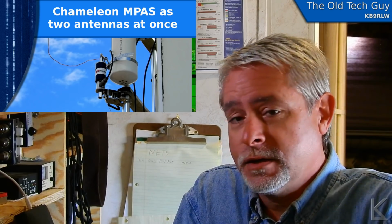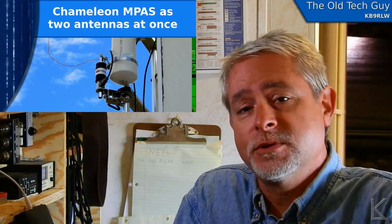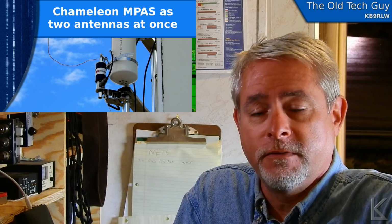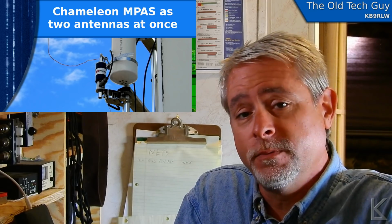I've been talking to some guys on 80 meters, 75 meters at night. The footprint seems pretty good. I got from here up to Middle California okay, and I talked to James just 112 miles or so north in Kingman. So the NVIS wire is working great for 75 meters. 160 was not usable last night. Too many static crashes from the storms out east.